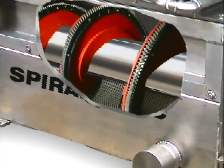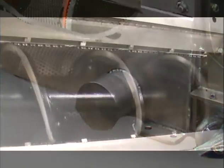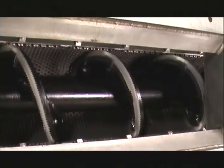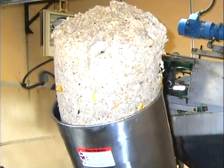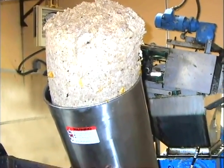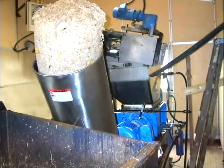Next, organics are flushed down the unit's liquid return line. The SC's oversized screw, driven by a powerful gear drive, then presses the solids and pushes them out the unit's elephant trunk discharge. Washed, significantly dewatered, and ready for economical disposal.